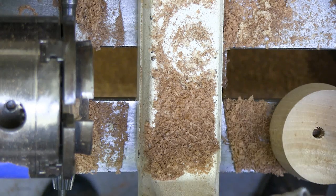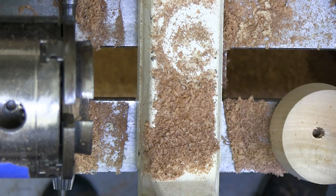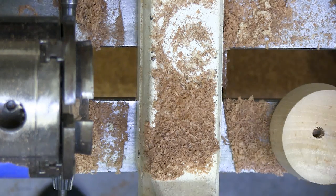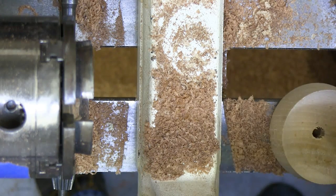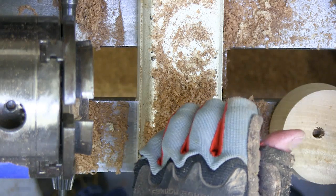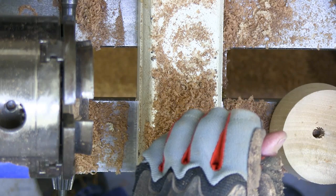And on my website, I have a handout for my inlay, how I do my inlay work. That handout needs to be updated. It's got the old reference for the turquoise in it, which used to be Walston Woodworks, and he sold the stuff to this guy named Tucker. So Tucker's Turnings is now the website, and I'll get that updated. But it's man-made turquoise. It comes in three grits: a powder, a medium grit, and what he calls chips. And I just use a mixture of those three when I do my inlay work.